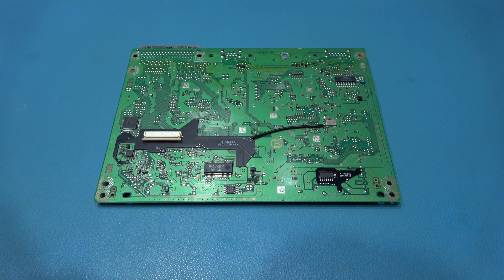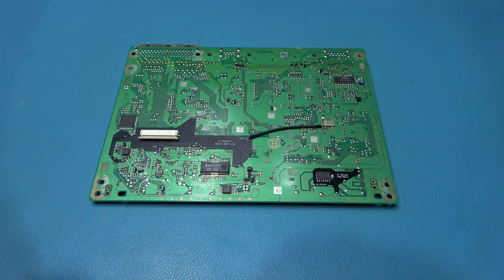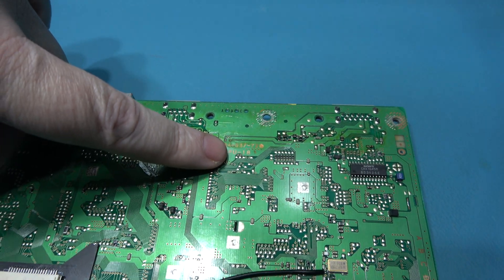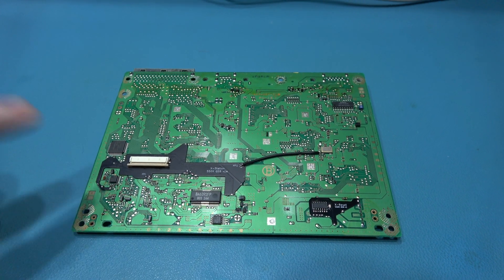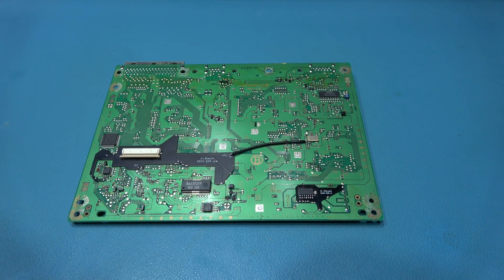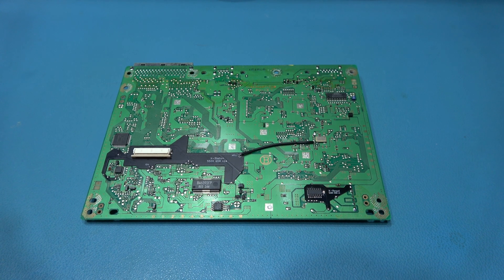And as you can see I've got my PlayStation motherboard all stripped out ready to go. If you take a look at the model number you can see it's a PU18, and you can probably already notice there's already a couple of mods on there. It's got an X Station in it and an in-game reset. So what I'm going to do now is start installing the DFO, dual frequency oscillator.